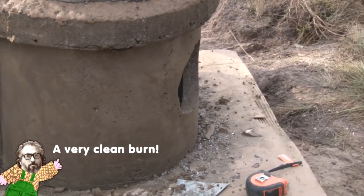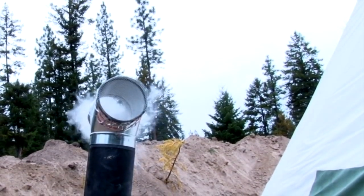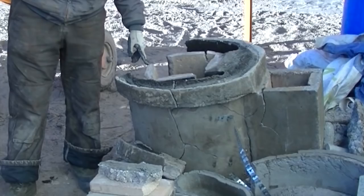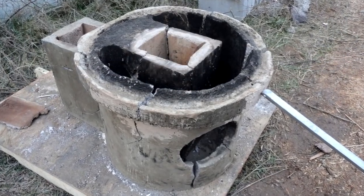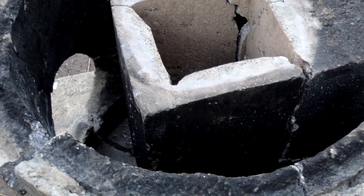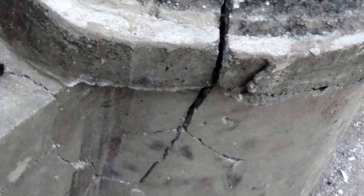From what Erica said, the instructions call to first fire these in — it's supposed to hold 110°C. After about a week of use, the core started showing more and more cracks. Eventually, the core had to be removed. You can see a lot of cracks where the core was weakest: pinched corners, where we cut the hole, etc. We were expecting expansion strain problems, but we also had cracks where there's no obvious expansion from the heat. We may just have had frost cracking in the thick parts where it was wet, on top of everything else.